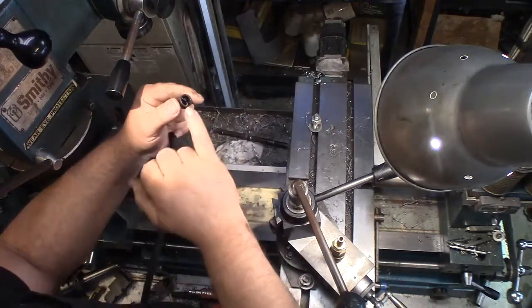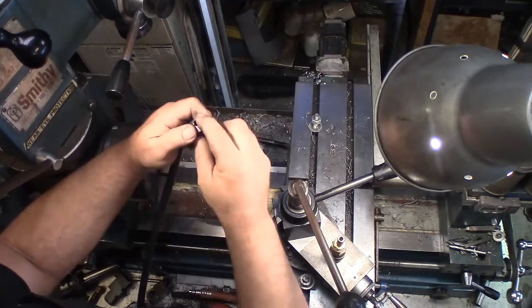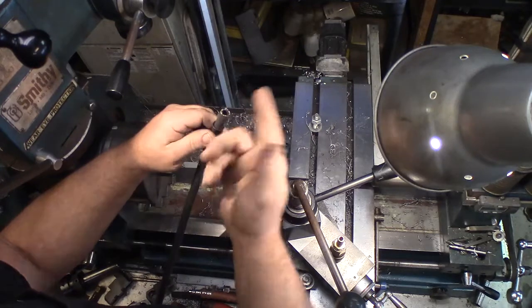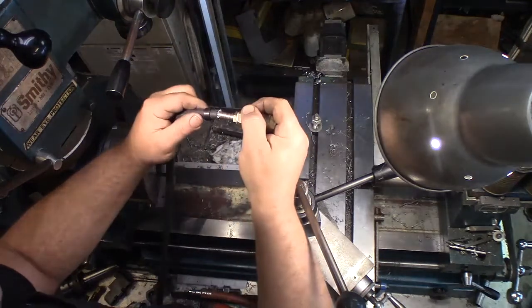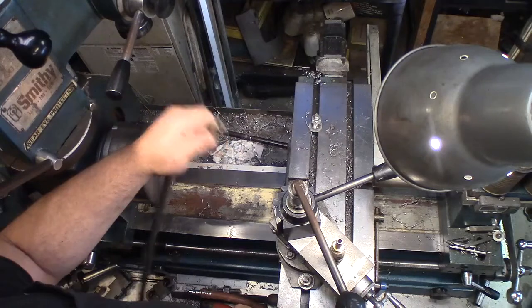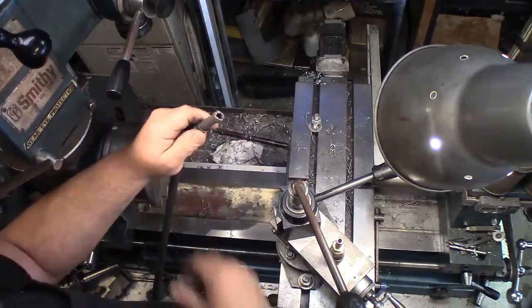On the lathe, I'm going to put a slight chamfer inside these rings to allow it to sort of skim over the rubber without tearing up the outer jacket, and we'll use some soapy water or something as a lubricant, and put a couple of these rings on with this system and see how it works out. So that's the plan. So follow along in my adventure to see if this thing shoots across the room or it actually provides a viable fix.